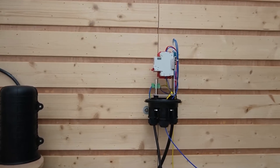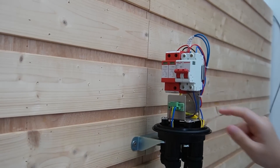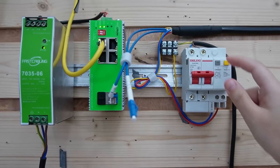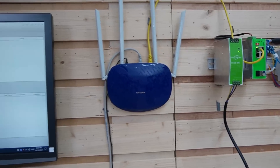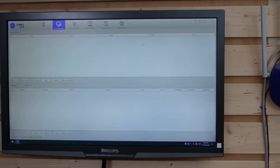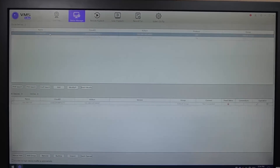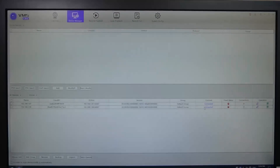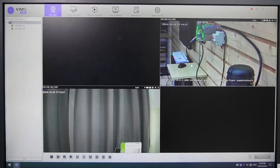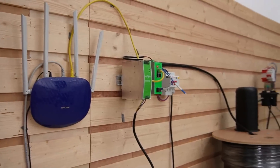So now let's move to the back and connect the ethernet cable with our bullet cameras. The setup is basically completed. Now let's turn the switch on — make sure you turn on all the switches at the end of the setup to ensure safety. So let's move on to our computer and go to our VMS software to view the live video feed. Let's search for our bullet cameras — here we go. They're connected already. So now I'm going to go over there and wave my hand, so you can see this is an absolutely live video using our composite fiber optic cable.